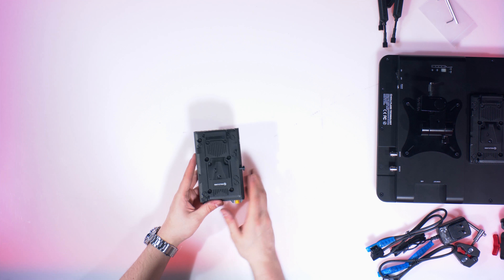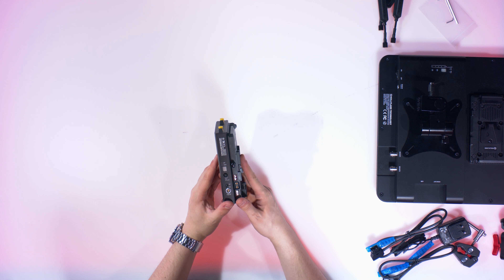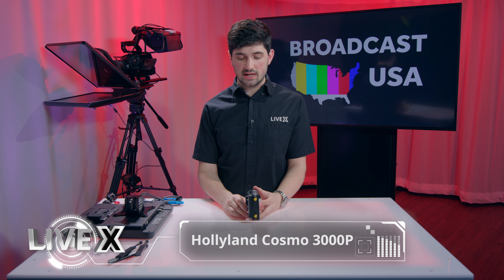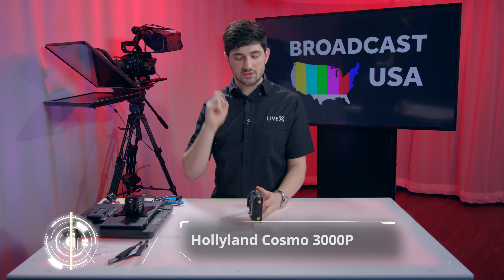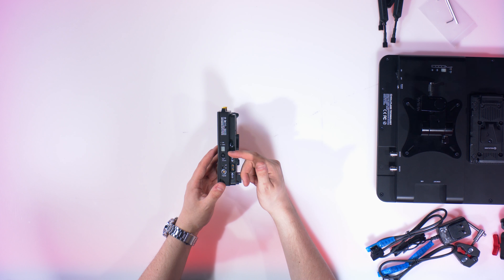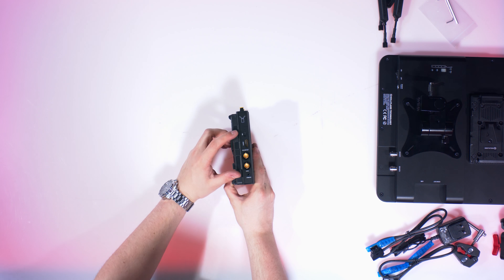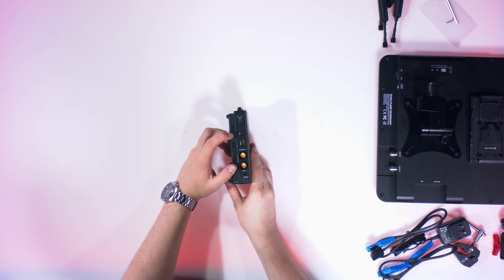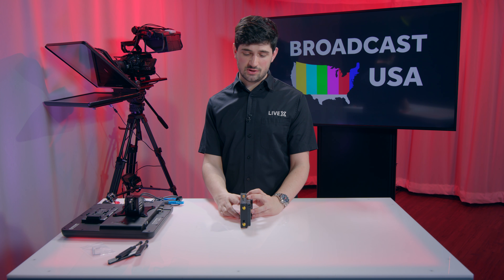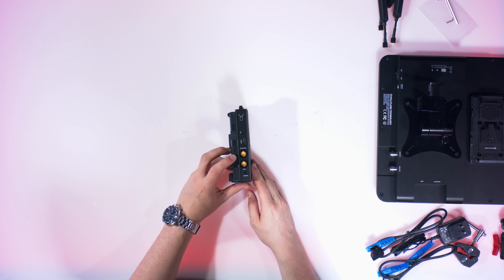This unit is V-mount powered — you'll plug in a V-mount and D-tap off of it to power the actual unit. On this side is the channel coordination, which works kind of like a walkie-talkie: you pick your channel 1 through 10 and just match them on either side, and that will coordinate the frequencies for you. It actually does scan and change frequencies if there's any interference, which is pretty cool — and awesome if you're using more than one set so you can make sure they're not going to interfere with each other. You'd pick your channel here, establish link and video here, and there's an on/off switch and power port. On the other side is the actual I/O: a mini USB for firmware updates, and an HDMI in and an SDI in. One thing to note: it will not act as a converter, so HDMI in gives you HDMI out, same with SDI. You also have an SDI loop out for a monitor on a camera, and a stereo in if you want to attach a microphone.